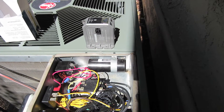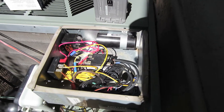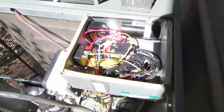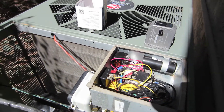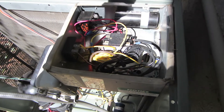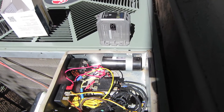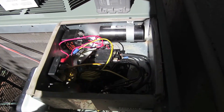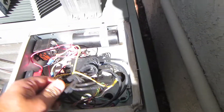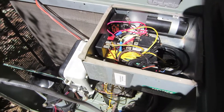I'm going to take this two-pole contactor out. Originally it was a single pole contactor, but it's been changed out before. This condenser sees a little bit more activity because it's on a two-zone system, so with the zero point switching it's going to help — no pitting on the contacts. There are a little bit of extra wires here because of the smart box; we've got to adapt for that.